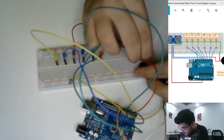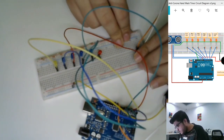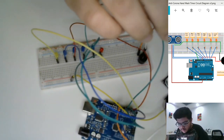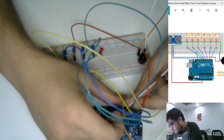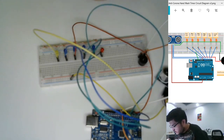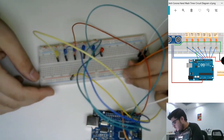Make sure you wire the buzzer in the proper pins. The positive terminal goes into pin D10, right next to the two pins connected for the ultrasonic sensor. As for the negative end of the buzzer, we'll connect it to ground.